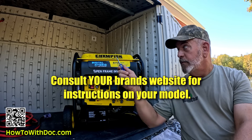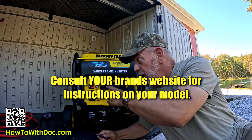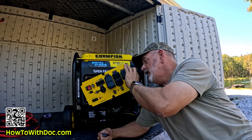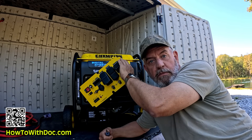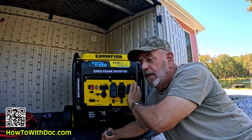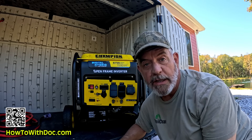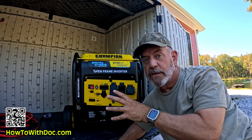Champion is really good on their website — they have a video showing how to remove the neutral bond. There are six screws on the front of the generator; you turn it upside down and there's one bolt underneath where the ground and neutral connect. I need to disconnect that, take the white wire off, and wrap electrical tape around the white wire so it won't touch anything. Legally I'm supposed to put a new label on the generator stating it's no longer neutrally bonded. You don't want to then take this generator out to a job site because there's no longer a neutral-to-ground bond in this system.